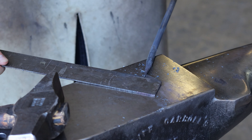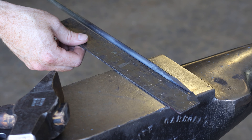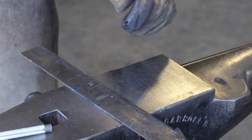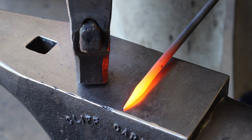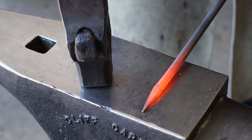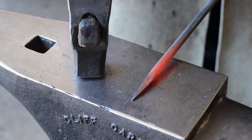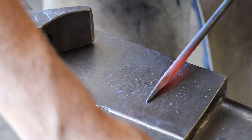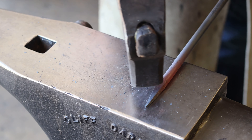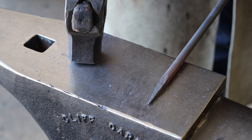I'm going to do a check here. That's pretty accurate to a 1/16th of an inch. I've got that sitting right at an inch and a half, so I need to extend it another quarter inch. I'm going to make sure everything is nice and smooth before moving on to the next taper. By forging in the middle of the taper first, I want to thin the taper down and get as much length out of it as I can, because it doesn't need to be a big honking taper. Still sitting pretty solid at one and a half inches, so I'm just going to extend that a couple hammer blows here.